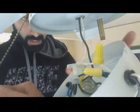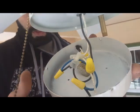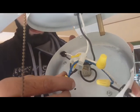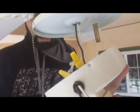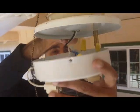All the wire nuts are nice and tight, and that's what the final wiring should look like. Essentially I removed the ballast and bypassed it by hooking the white wire to the white wire going to the light, then black to black — though I did have to add a little blue jumper because the wires were too short. Now we'll just seal everything back up and install the light.